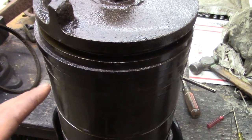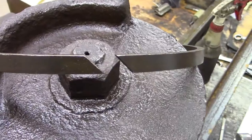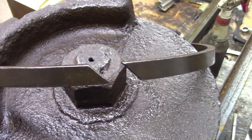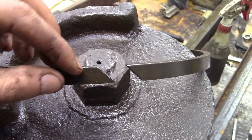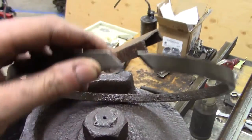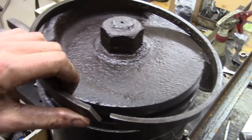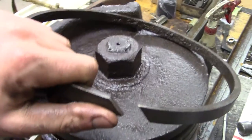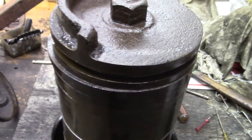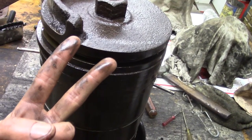I've got to take the rings off. However, I don't have a piston ring expander that's this big. Also, a couple of the rings have this sort of angled end on them and you couldn't even really get an expander on there because it would just slide off. I learned from replacing a ring on my four-and-a-half horsepower United that you can't just bend one end up over the land and work around with a screwdriver because you're gonna snap the ring. Luckily I learned that on the bad ring. But I developed a technique that worked pretty well — I've used it a total of two times, so that makes me a qualified YouTube expert.